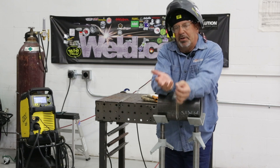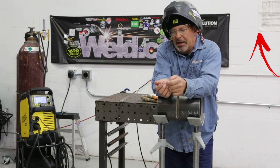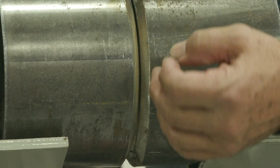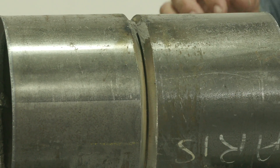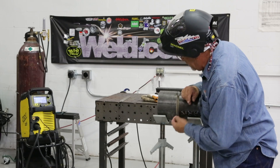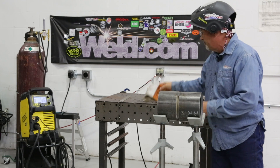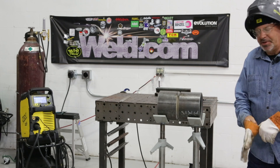A gentleman from South Coast Welding Academy, Hamar Aguilo, and I have done some technique contrast videos where he likes to manipulate, and I just like to stick it and go. Whatever needs to happen on this, I need to first recognize where my high-low is. My low part is away from me. I'm going to be over here welding uphill, so I need to make sure that I'm getting into this and building the profile. I may need to slightly manipulate, point this wire back toward me just a little bit. When we get into it, we're going to look at our keyhole, and whatever needs to happen, we'll make our adjustments on the fly.